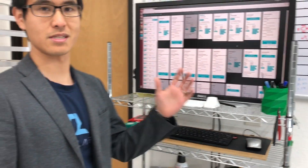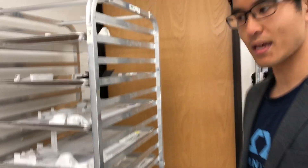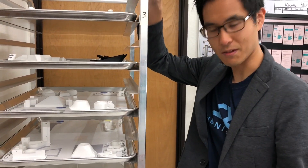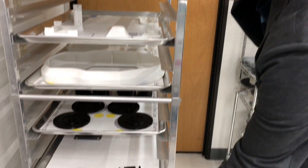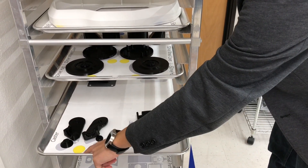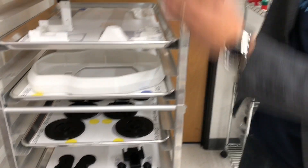We make this process really optimized and as efficient as possible. We even wrote our own web-based software to control and manage the entire feed of printers. For production we have two cycles a day — a day and a night cycle. We have these Kanban carts where every part has a place, and we know the print name and whether it's a day or night print. We fill up these racks and send them off to assembly, just 20 feet away.